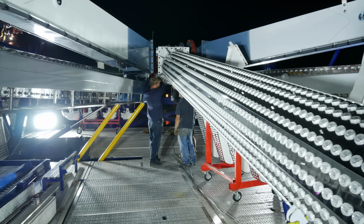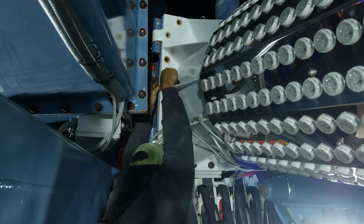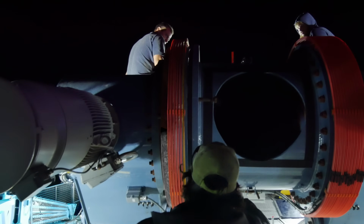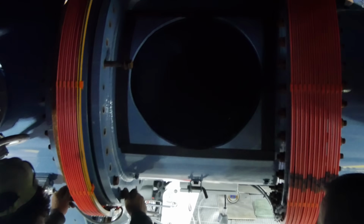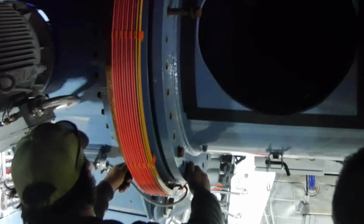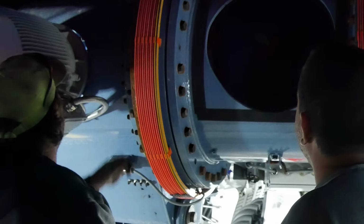With the swing arm rolled into position, the hinge plate is bolted, making a solid structure. Incidentally, I've been asked a few times how electricity is transmitted through rotating joints. These are the slip rings that make that possible, and I'll talk about that a little bit more later. The last step for the night was to install bolts through this large bearing, tying the front and rear of the ride together through its pivot point.